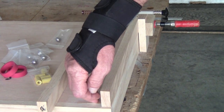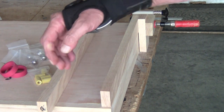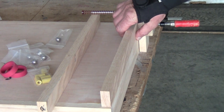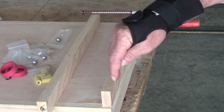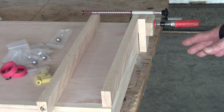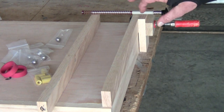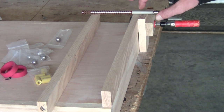Okay, so I'll probably do 1/4 inch, so I use 1/4 inch glass on it. Okay, from that point, I'm gonna take this piece and I'm gonna glue it down to this piece with three wood screws, and then I'm gonna plug those wood screws so you don't see them. See, from that point, once this dries, I can actually sand this whole surface down. This will not be on there yet. If I can sand this whole surface up, then I can put this on last.